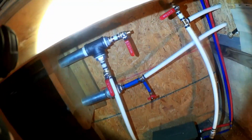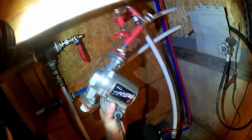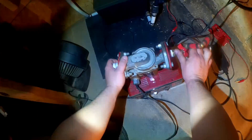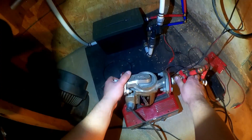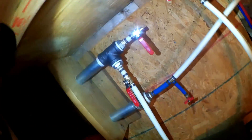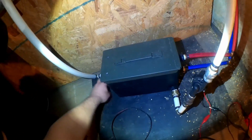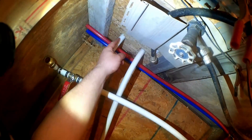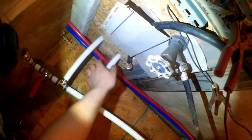And there you have it — piping hot water. Well, certainly piping, anyway. I was able to eliminate this traditional circulator pump that I was using for the heating system and replace it with one of these cute little DC ones, going from drawing about 50 watts or so on low down to about 15 watts. And that little pump does a great job of circulating all the water necessary from the wood furnace through this heat exchanger, creating the domestic hot water, and on to the radiators in the crawl space that heat the house. All this can be explained much better with a good professional drawing.